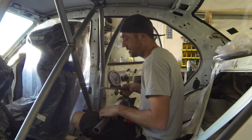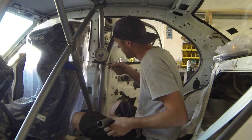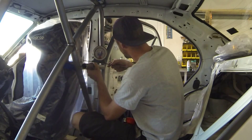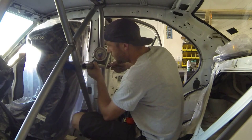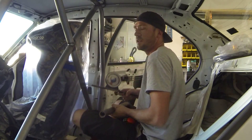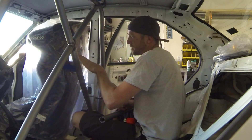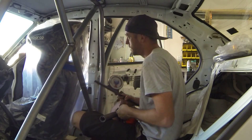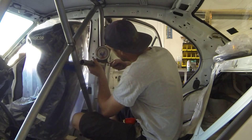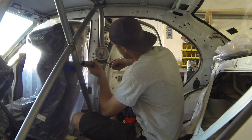I take a piece of flat stock with my protractor on it and measure up roughly where we're sitting. The reason I go slightly under the maximum is so that if the driver ever wants to change position, it doesn't knock them out of the rules. Also remember that the HANS device and shoulder position change things too — go about halfway up the hole in the HANS system, measure downward, and from the bottom of the seat itself to get your range of harnesses.